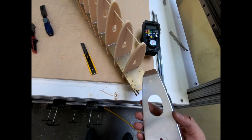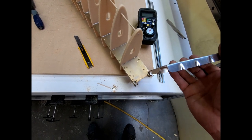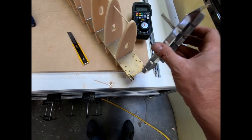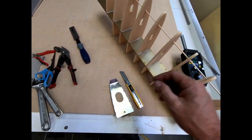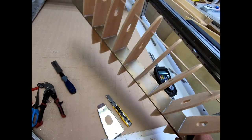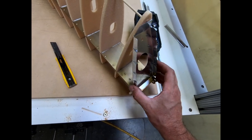All right, I went over to the bending machine and just bent this lip up to, I think it's 29.7 degrees, and bent this other one down from 90, the same amount, that 29.7 degrees in the back here. So bent those two, and then I was able to pop this out of the comb that I had it in, and this weighs absolutely nothing. It's virtually weightless.